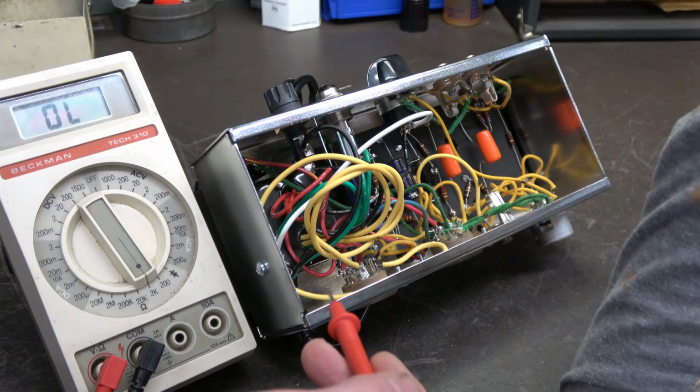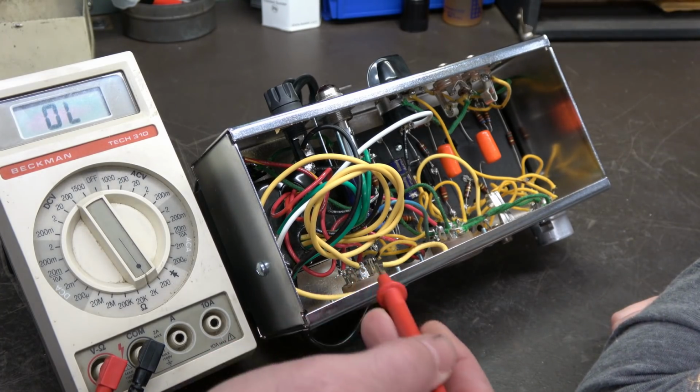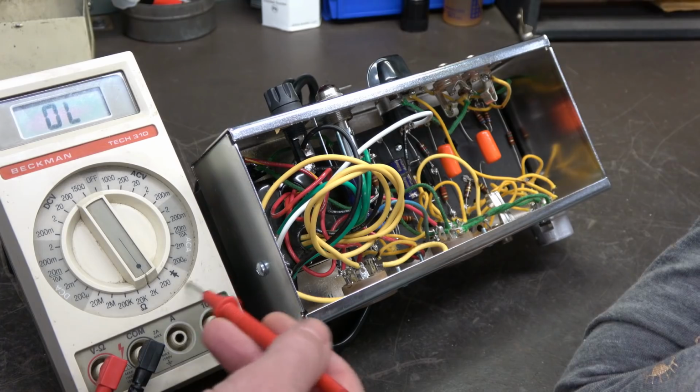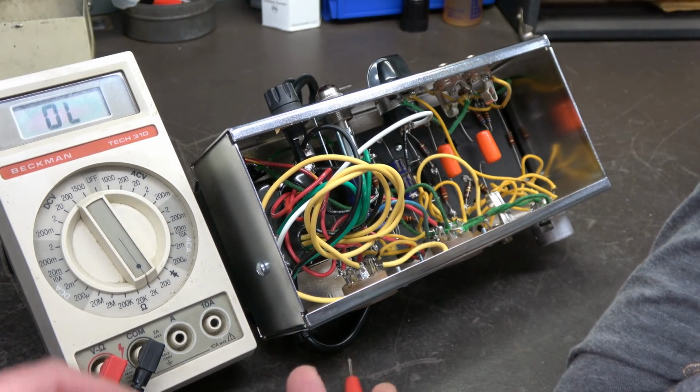Yeah, but what should that center tap measure? If you got 255, you said, across these two, and this is in the center of that, what would you get to that center tap for a number? I'd say around 120. Okay, good.